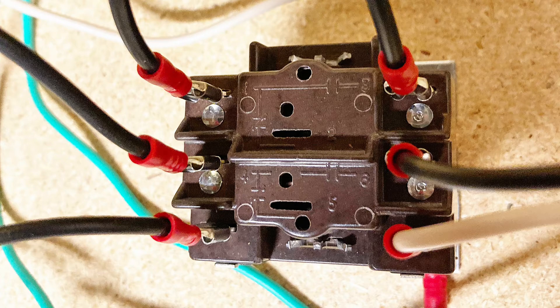For the coil, you'll have a hot wire coming in on one side and a neutral — sometimes called a common — wire coming in on the other side. The 24-volt hot will be black. The 24-volt neutral or common is going to be white.